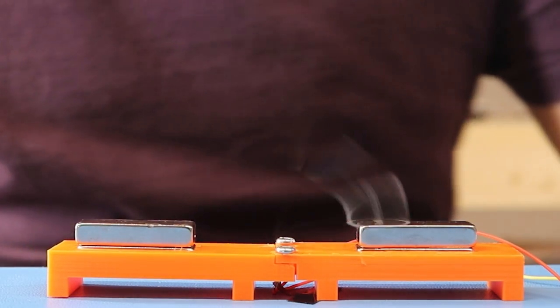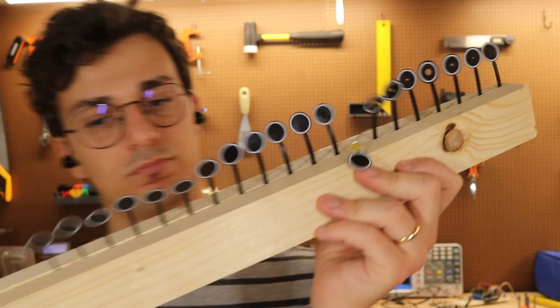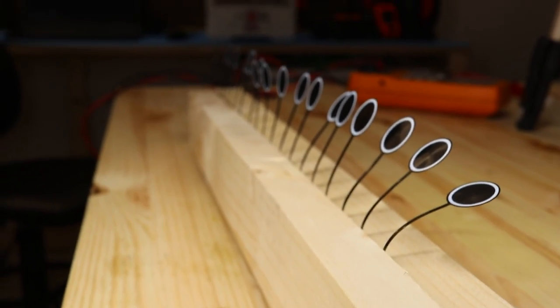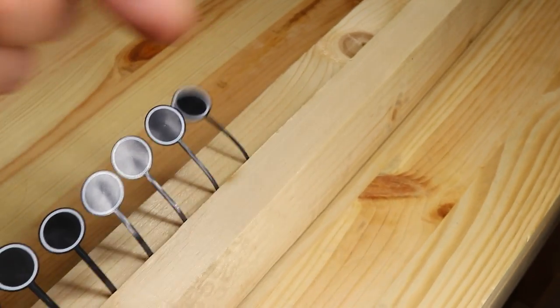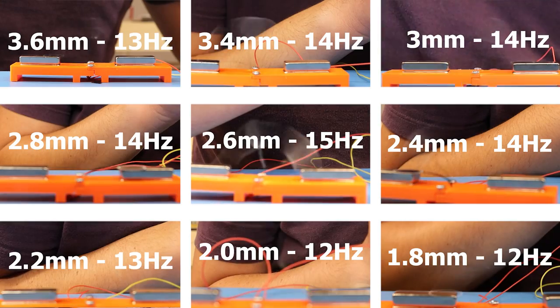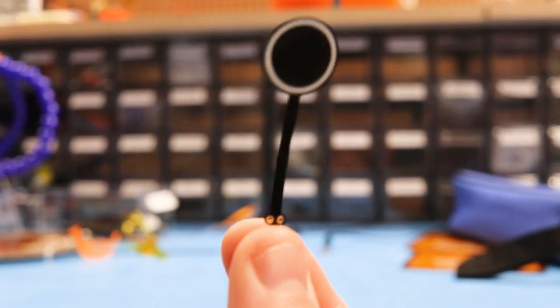This experiment got started with me trying to make the actuator flap faster, because I wanted to improve the refresh rate of my flexible POV display. The coil here is like a flap, so what we need to do is lower its drag. The only things I could do was either put a hole in the coil or make the arms more flexible — the smaller the arm width, the more flexible it gets. To test this, I built a jig with magnets on each side to benchmark them, and many flaps later I concluded that the 2.6 mm width was the fastest.